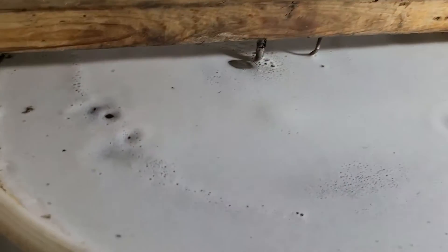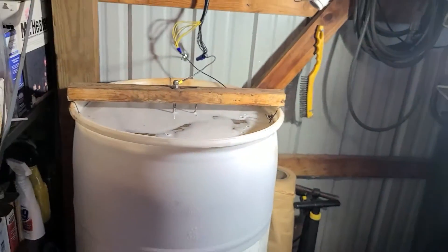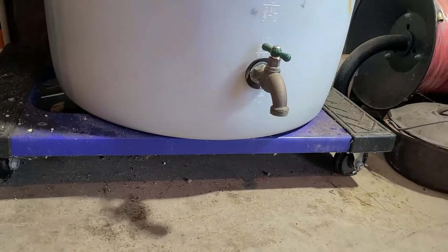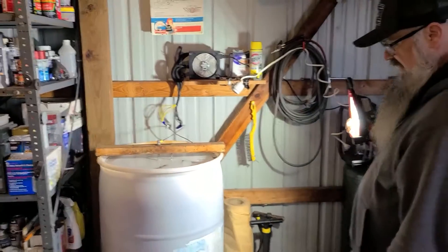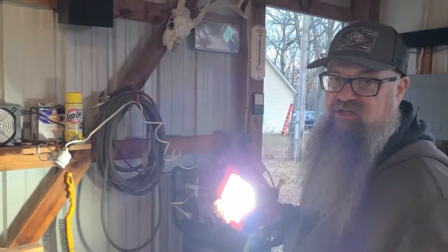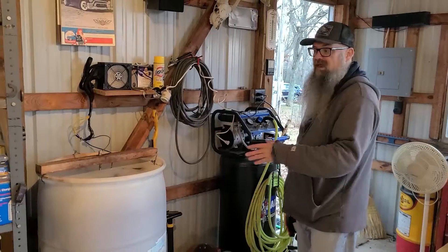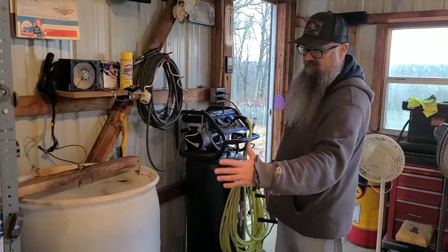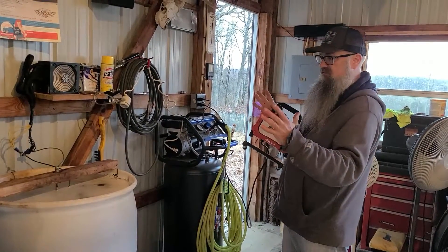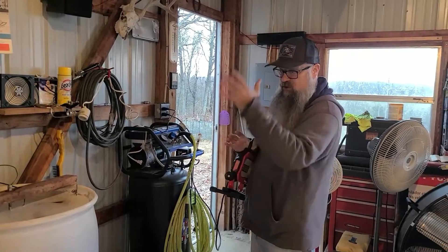It's not even five minutes yet and it's already filled with foam on top, so it's doing its job — getting clean as we speak and none of this stuff leaks, so it's turned out to be a pretty good setup. Like I said, I started out with just a plastic tote with a 2x4 across it and it worked just as well; the only disadvantage was size limitations. Also, your sacrificial metal has to be the same depth as your pan for it to work correctly — if the metal only goes down so far and your pan hangs deeper, that bottom half won't get clean.